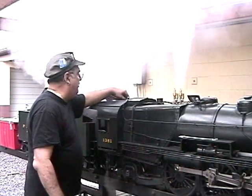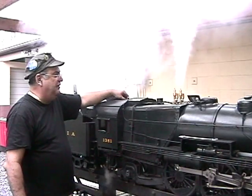One should be the one that works all the time. A 120 valve should be about 2 pound differential. The 125 valve should be about 5 pound differential. And that's the way I got them set. And they work perfectly, man. Work perfectly. I'm gonna really crank it up now. Let's just see both of them go off.